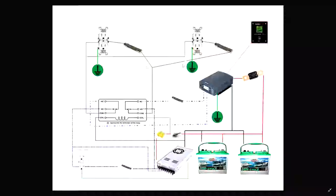And of course, everything connects to a common ground. That is critical. So your outlet ground doesn't fail in a power failure because it's literally connected to Earth, okay? Just remember that, folks. So the ground's from the receptacles to the ground on the inverter, and then the inverter's ground will be connected to the ground of the outlet, which will also ground the PSU. That makes sure everything has a nice consistent ground and there's no differential voltage that may blow stuff up.